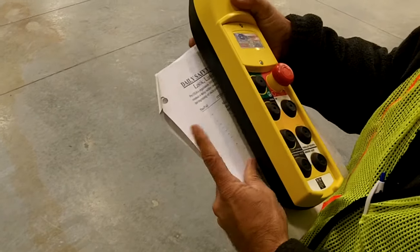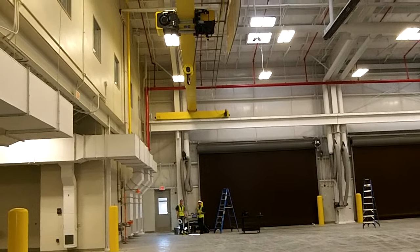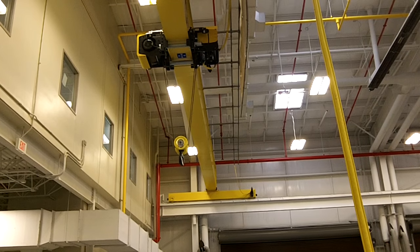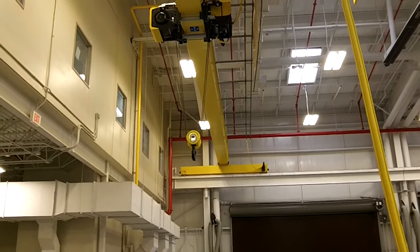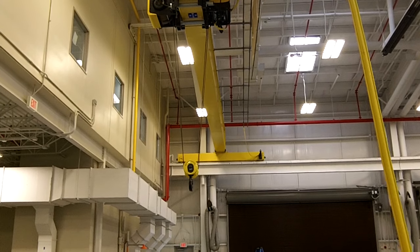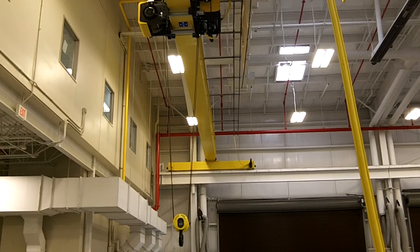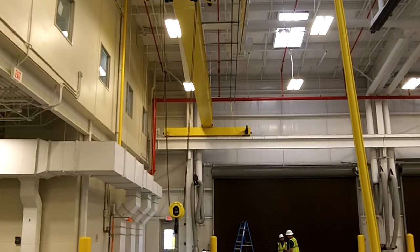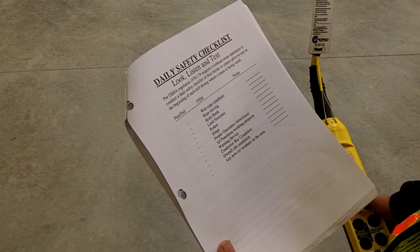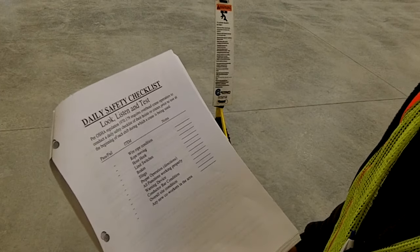You want to check the condition of the wire rope. To do that, you can simply run the hoist down. As you're running the hook block down, you want to look — we're checking the wire rope for kinks or frays. It's a visual inspection. You also want to look at the drum and make sure that the wire rope is paying out and back onto the drum correctly. If there's any crossover of the wire rope on the drum, stop immediately and do not proceed with operation. Next on the list is rope reaving — make sure the wire rope is properly reaved through the sheaves and on the drum. That's a visual inspection.